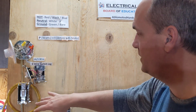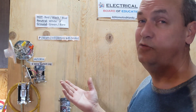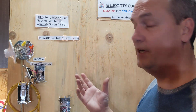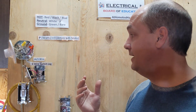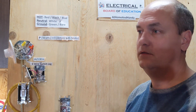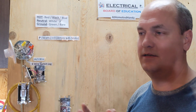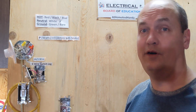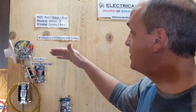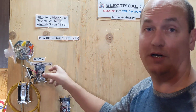If you're running it surface, like I've put a couple of switches in the garage here where it's surface, I still did a two wire just because if I ever want to change it, I have access to it — I can just change it out. If you're doing anything in the wall, definitely go with the extra wire and have a neutral in that box, because to try to change it in the future would be a nightmare. So definitely don't mess around then. It was good practice before; now it's code. That's why you now have to run a neutral in your switch boxes when you're running a switch leg. Hope that helped.